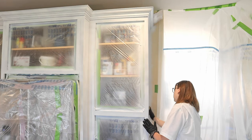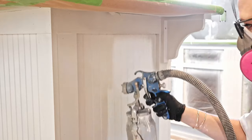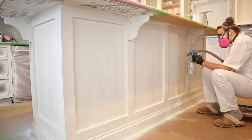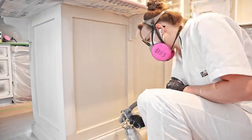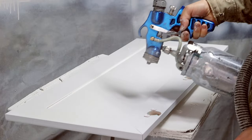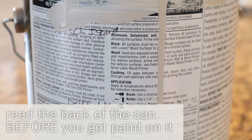After all of your coats of primer have dried, lightly smooth it with a fine grit sandpaper before moving on to painting. We have painted 14 plus kitchens over the years and our recommendation for the best paint to use on kitchen cabinets is Sherwin-Williams Emerald Trim Enamel in semi-gloss sheen. We typically don't gravitate towards semi-gloss, but Sherwin-Williams' semi-gloss sheen is not too shiny and their satin sheen is not shiny enough for kitchen cabinets. All of the paint colors we chose for our kitchen will be listed in the description. We did two coats of paint on everything including both sides of the doors and drawers. No matter what paint you choose to use, read and follow the instructions carefully to get the best results.